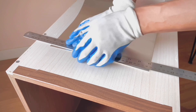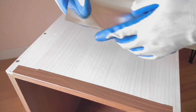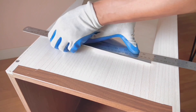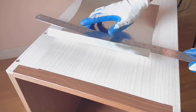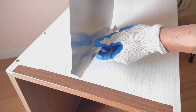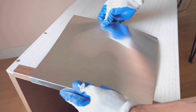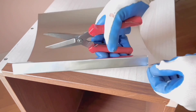Now it's time to attach the aluminum. I'm just folding over the edge of the sheet to tuck away the sharp inside. Then I'm starting to bend it over around 1 inch upright at 90 degrees. I'm bending some more at 2 centimeters thick at the edge of this box, so now we've got a U-shape head for covering the edge. Here is the tricky part — covering the corner. All I need to do is cut the sheet off around 1 inch at the U-head like this, for covering over the other side.